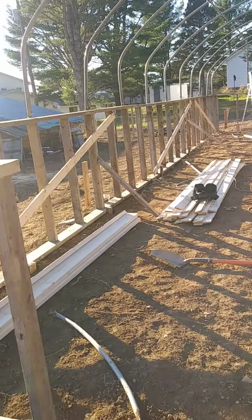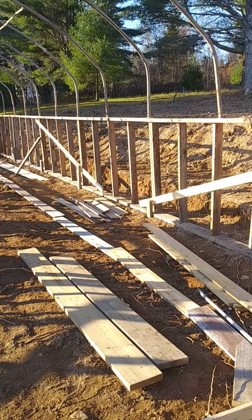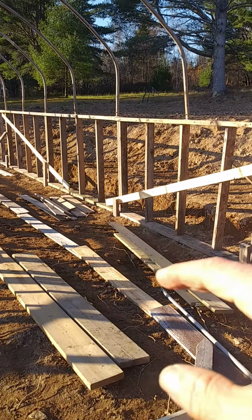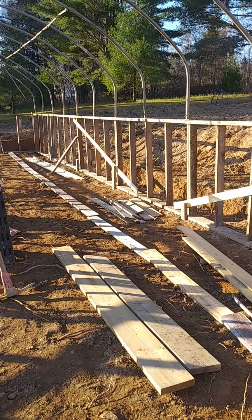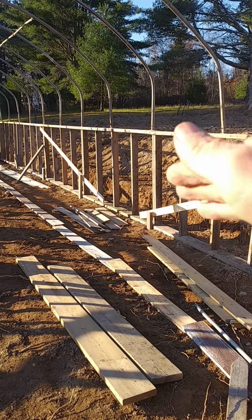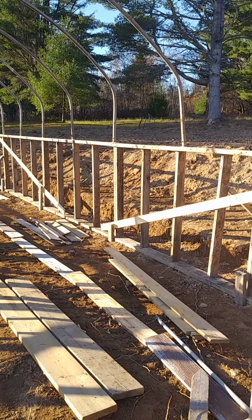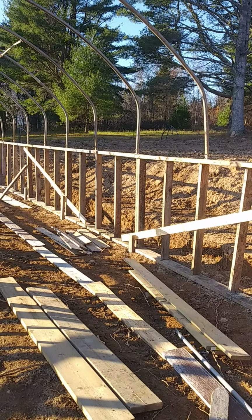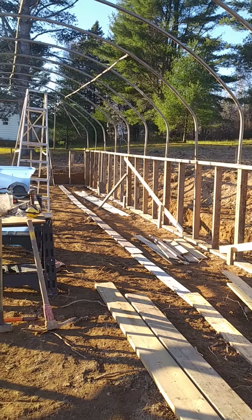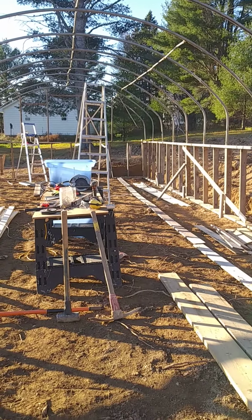So little bracing over here. I will put some anchors out into the dirt and dig down and latch them to it, probably about four, and then take that material and bring it in and slope it up against the back side. I'll put some plastic and insulation in the back side of that as well, and that will be ready to rock. And hopefully this afternoon, when Pat shows up, I'll get these last two on and then get the structure in the doorway.